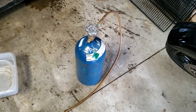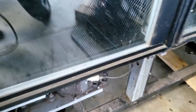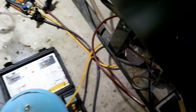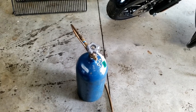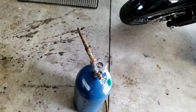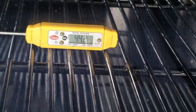That right there is probably not the safest thing in the world — you'd never want to put a nozzle on it — but you can get real pressure through that nitrogen line direct off the tank. I was able to blow all that garbage off the condenser coil — you can see there's hardly anything left on that shield anymore. Head pressure dropped from 220-something down to 205 and suction came down too, which is good. Just a disclaimer: do not do that — it's unregulated, potentially 2,500 to 2,800 pounds of pressure, and you could take your eye out. I never started doing that until about two years ago and it's worked awesome, but it is not safe.